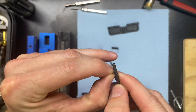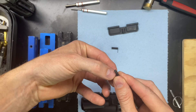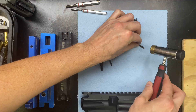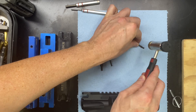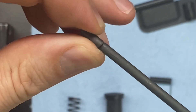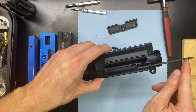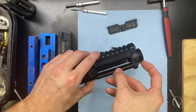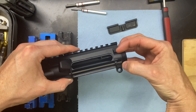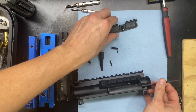Now, when you get it in, it's not lined up very well. I may have to start this off camera. Alright, we got it on. What this is going to do is it's going to prevent the guide rod from slipping out of the back — it would go in like this. We have that C-clamp right here, and it allows it to go all the way back, and then it will stop right there so it won't be able to slide through. And once you put the barrel nut on, that's going to prevent it from sliding out this way. Alright, we have that on — let's go ahead and get our dust cover on.